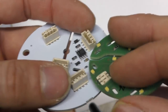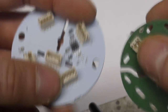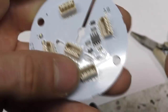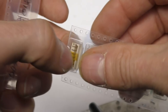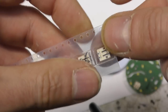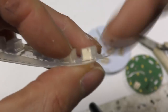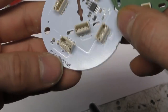It's their 9159 series. There's quite a lot of different connectors. I think from memory these are 9159-551. They do these in a few different numbers of ways. They also do through board and surface connectors. The surface ones come with a tab for picking up on the pick and place machine, and the through board ones come taped upside down. They're basically the same connector. There's just a very slight difference in the way they form the leads, so that the through board ones just drop down onto the PCB. So there's quite a lot of flexibility for plugging PCBs together in various different permutations.